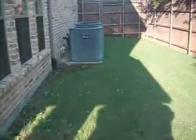Left hand elevation, flat work, it's in good condition, no apparent cracks in it at the present moment. There's a grade at the rear elevation of the fence running down the swale. There is a gap between the bottom of the fence and the swale, which is good. Here the landscaping is draining down towards the back of the building, and you've got a swale to take it out. Around the swimming pool you have good flat work. It's got drainage in the flat work, and I can feel as I walk through it, it drops down, which is good.